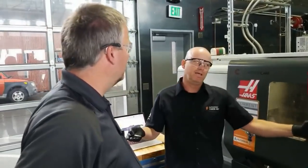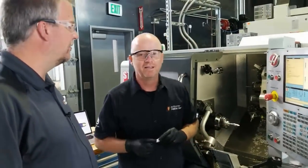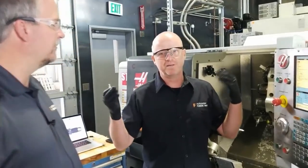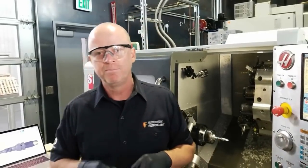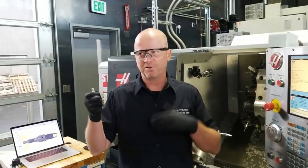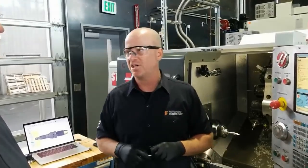Yeah, so again, it depends on the environment and the workshop. In my past, I was at Tesla, and over there what the guys in the shop did is we had a number of machines, and the first 20 or 30 tools all matched on all the same machines. So when you program a job, you wouldn't even worry about which machine; well, you need to know roughly what machine you're putting it on. Then you'd get out to the shop and see what machine's available, and you post, and your first group of tools are all the same and they all match. We'd have a standard tool library that handled 80 to 90% of the jobs.